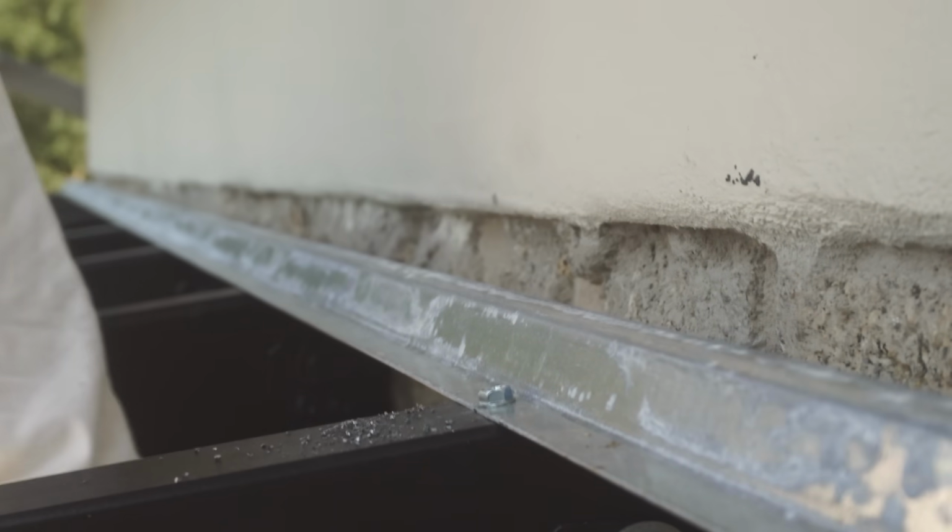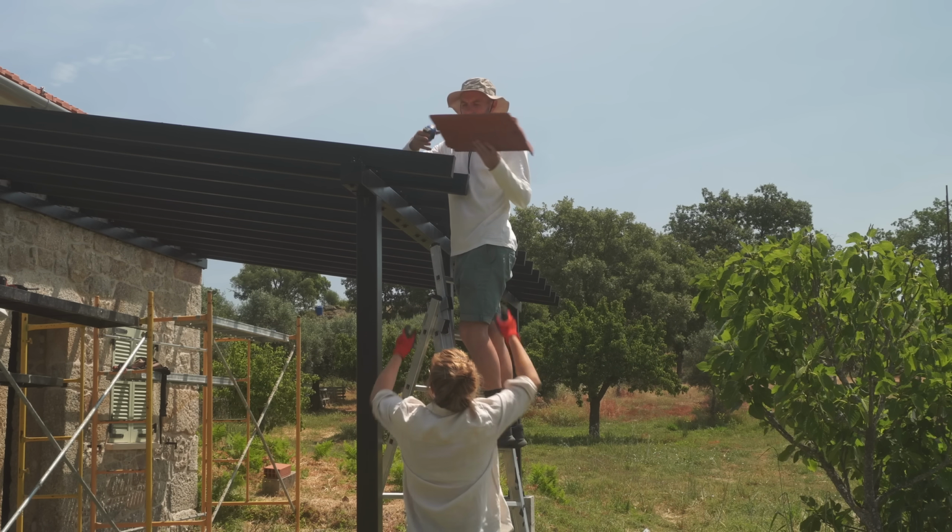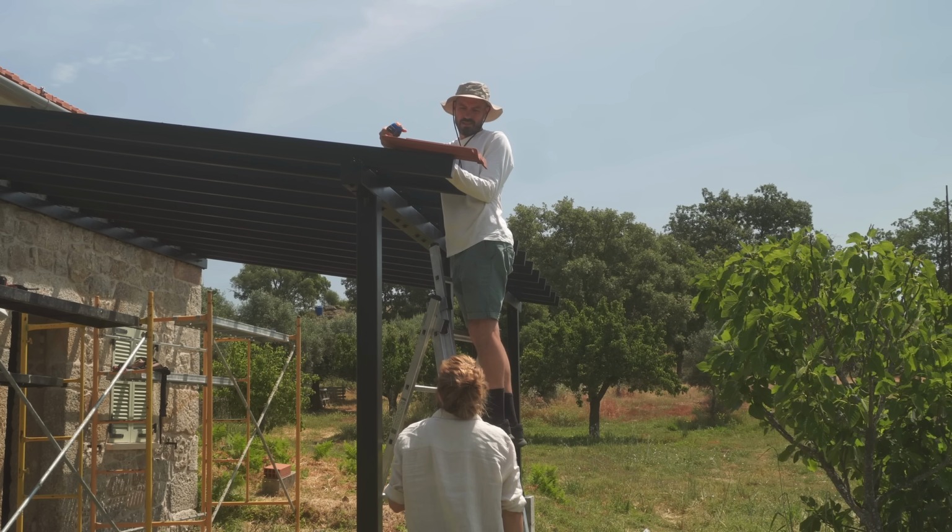We're taking our time here with this first batten, making sure it gets laid out properly because this prep work is crucial. Just making sure that it's, you know, perfectly perpendicular to the rafters, so it's all square, because that's going to dictate the line that our rows of tiles come off at. So we need to make sure that's straight. But yeah, that's all in, secured. It feels super strong. Now we need to move to the front one, which is a bit trickier because we also need to figure out the overhang of the tile from the rafters.